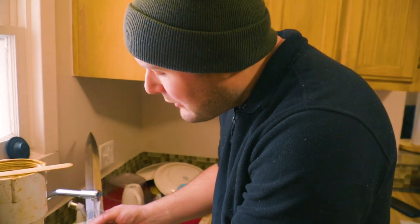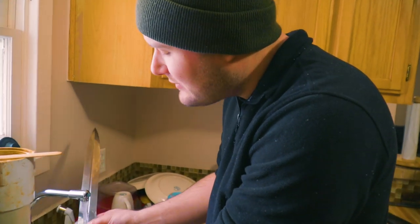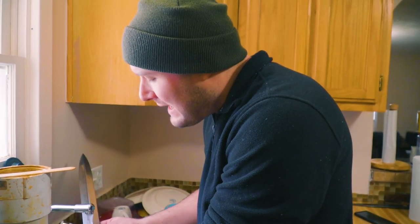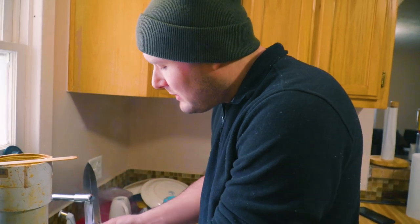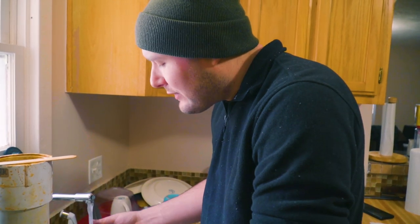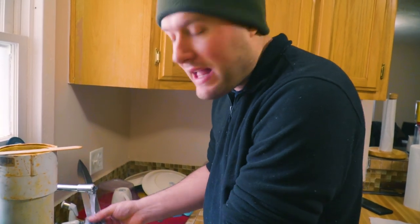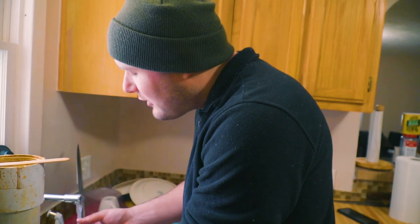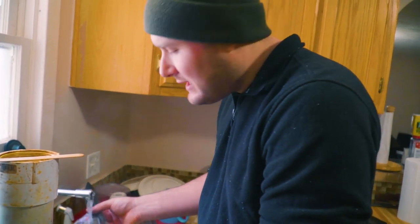Something I want to note about taking it out and sanding it in between the etching: I think it may end up making the Damascus really nice — possibly even nicer than what I normally do — and this may become a regular thing. I was using Windex with ammonia on it out there, and that helps neutralize the acid while I was doing that sanding, because normally I'm only sanding the oxides off for a minute or two, but out there I had it out for 10 or 15 minutes. You definitely want to make sure the acid is getting neutralized, because if it was out there for 10 or 15 minutes without being neutralized, the acid still remaining on the blade would be slowly etching it deeper and doing funny things.